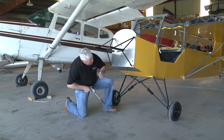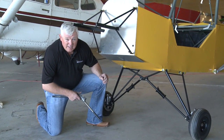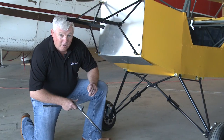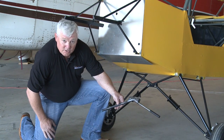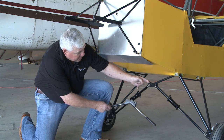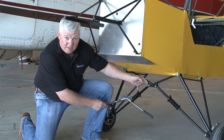This aircraft is mostly made up of aluminum, but when it comes to the landing gear assembly, it's made of 4130 chrome moly — and that's the part that I was welding in this segment. This is where it gets installed. Thanks for watching TIG Time. I'm Mr. TIG.